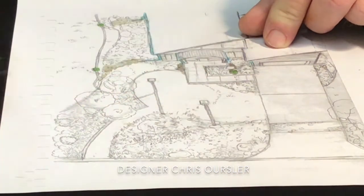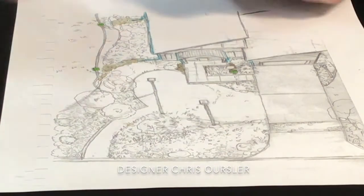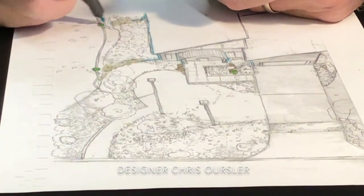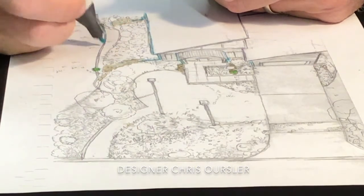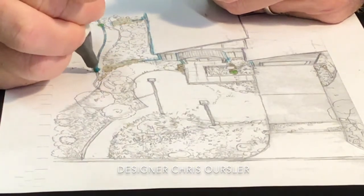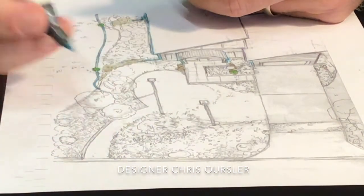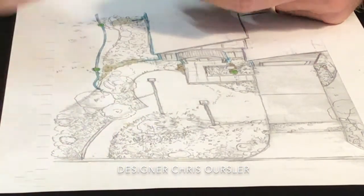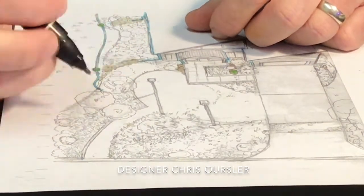And we're taking the water into the catch basins. And the catch basins then serve another 4-inch solid pipe. And then we're daylighting it again. And that daylight there is going into another little system. And this is kind of just an idea on a drainage system. This is just conceptual. This is not a real house.